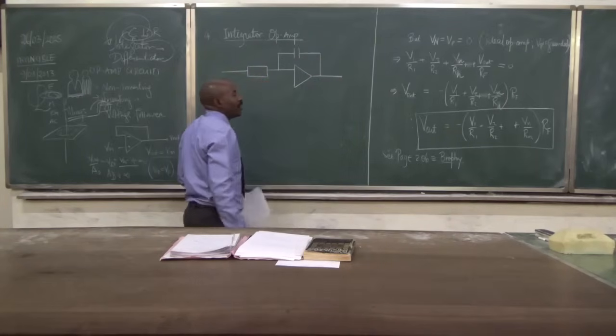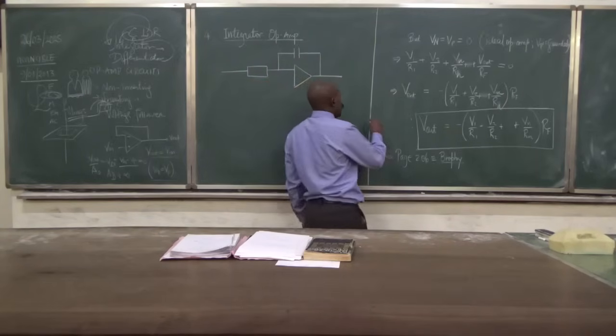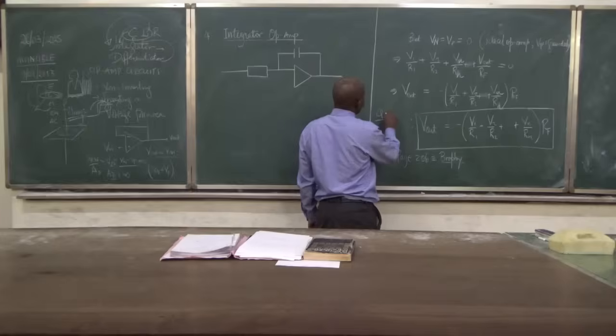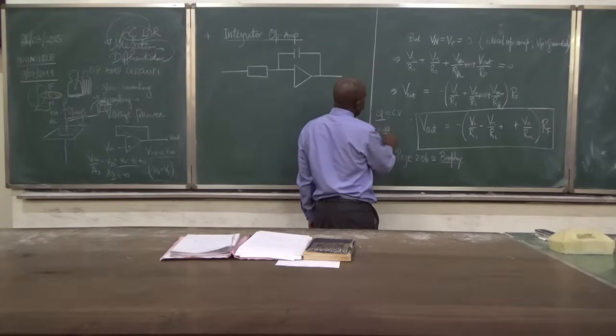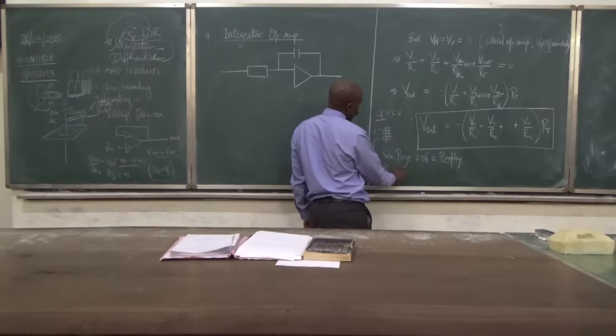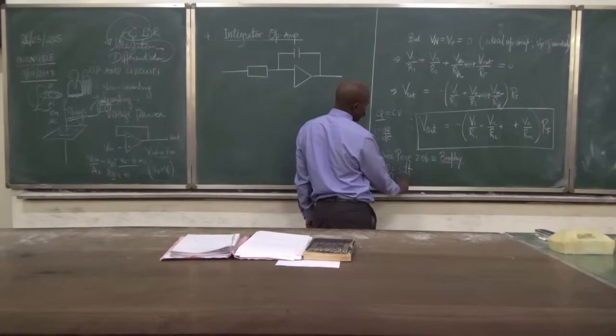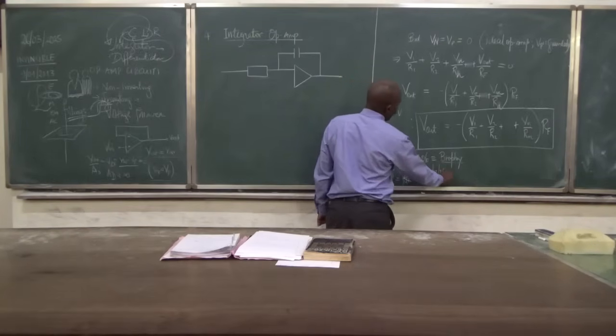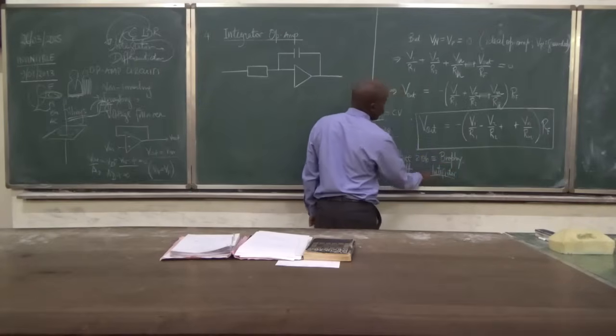So capacitance is related to Q = CV, charge, from I = dQ/dt. Then we have the charge being the same as I dt, and so the charge that we are interested in will be the integral of I, and hence the integral is associated with the integrator.